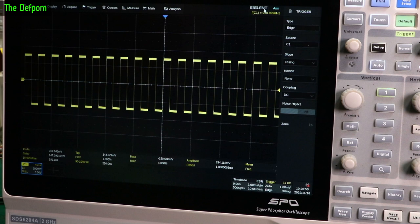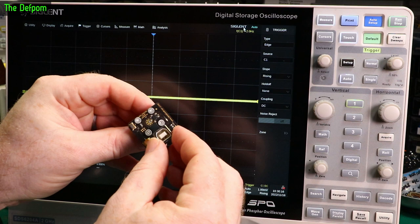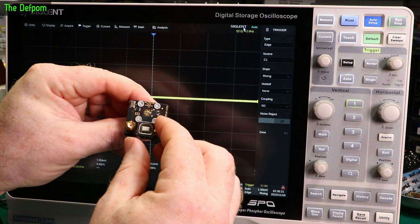Something that Rob gave me to play around with is this 40 picosecond rise time pulse generator from Leo Bodnar. I think I read about this on the forum a while ago. It basically just plugs into the port and generates a super fast rise time pulse, which can help you determine the actual bandwidth of the scope in theory. It's powered via USB and it's also got a trigger output which could be handy.